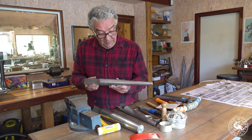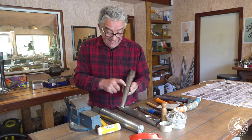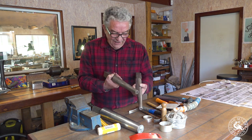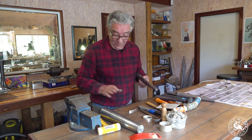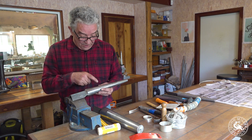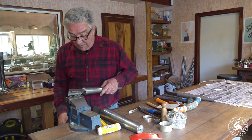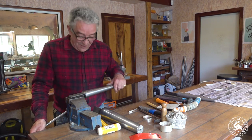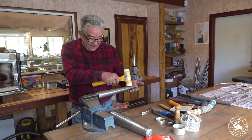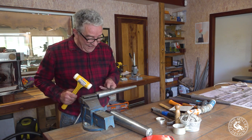Here are some steel mandrels that I've had made for me at the local machine service — this is high carbon steel. It's not too expensive, and mild steel tends to be a bit dirty and grey and lifts off onto what you're working on, so I don't use those anymore. I like my high carbon steel mandrels — they don't need to be tempered, because otherwise you damage your hammers on them, so they're still soft essentially. I've had angle iron brackets put on them so that you can set them up in a vise. Most of the commercial ones you buy, you can't set up in a vise — you've got to hold it in your hand and it makes life really difficult. So we can set this up beautifully like that — a sensational anvil for working on. Now I'm just going to belt this thing around.